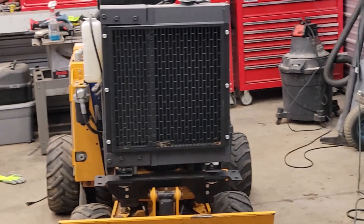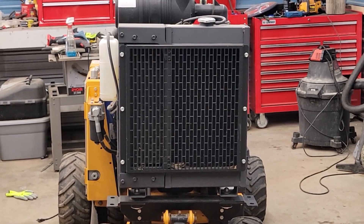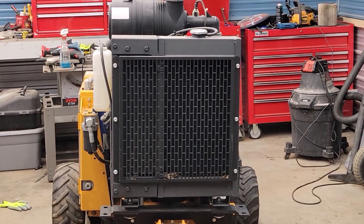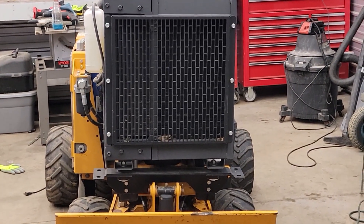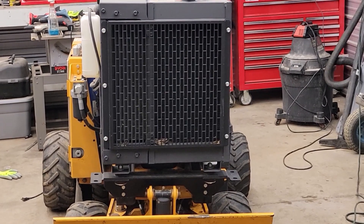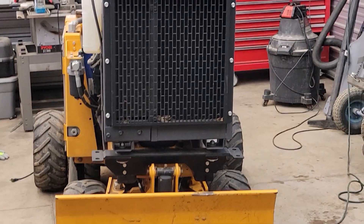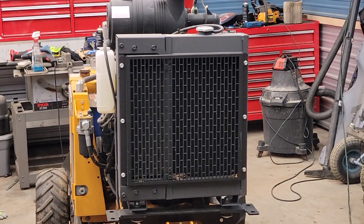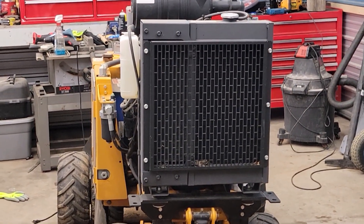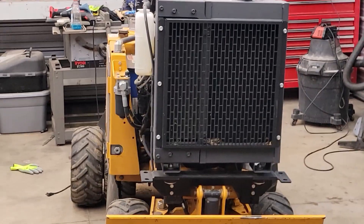News for the channel: Sherman is sitting over there — Sherman will be a year old in November and is going to be retired then or before. I ordered another brand new machine on Friday; I don't know exactly when it'll come in. We've got 412 hours on Sherman, and I like to rotate at 600 hours. These machines take a pounding and things start to loosen up. I'll resell Sherman, and it'll bring quite a bit, so I won't have very much invested in the next machine.